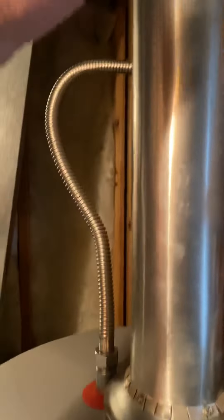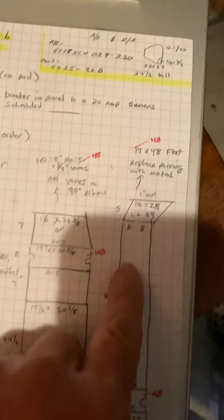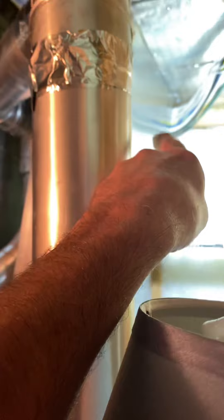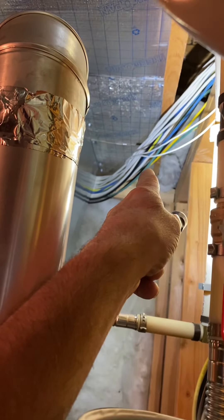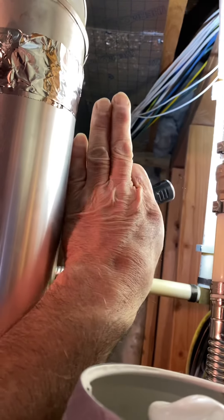What I would do is probably remove this flue and work going in and out above the water heater. So we need a 90, canvas, piece of duct, and a starting collar. On this starting collar you can see those wires here, so our new duct is going to go all the way here, and I brought the back forward four inches.